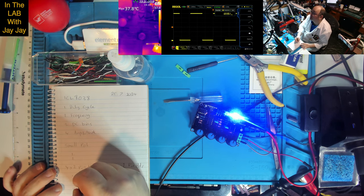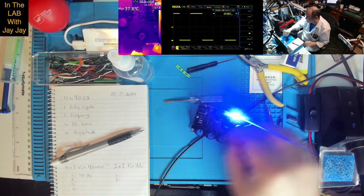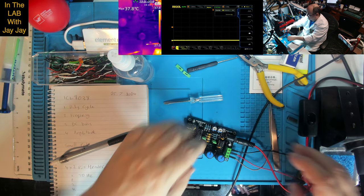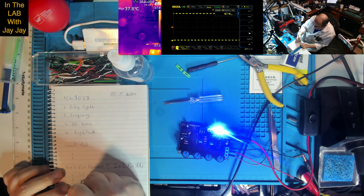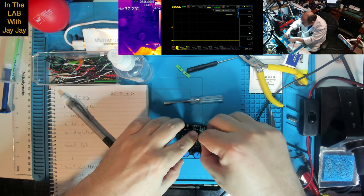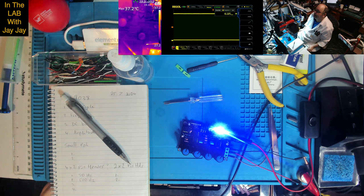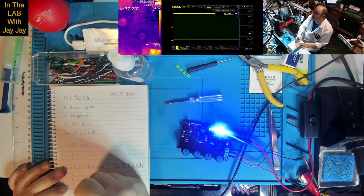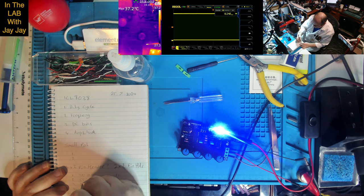for the square wave, that's 50 hertz, let's say, 50 hertz. And then for number 2, we just turn him off. Change the frequency, turn him on, and the frequency is 500 hertz, let's say. And then we'll turn him off, and we'll put him up to the next graduation, and we'll turn him on, and that looks like 16 kilohertz. So let's say 15K, 15 kilohertz.